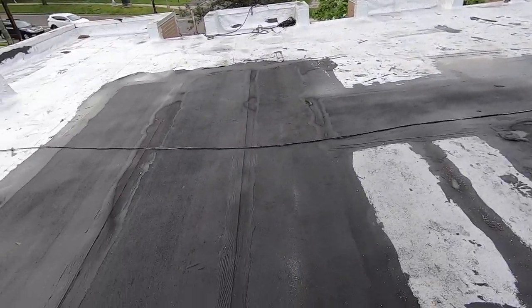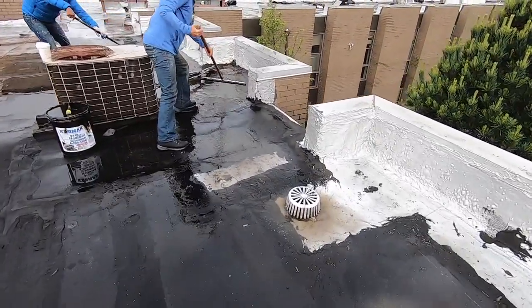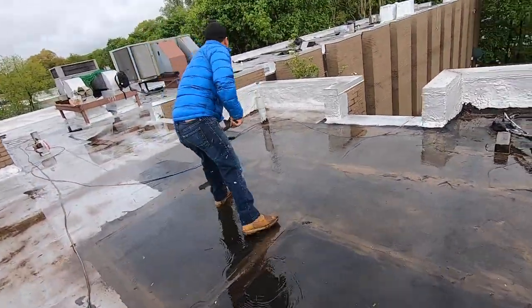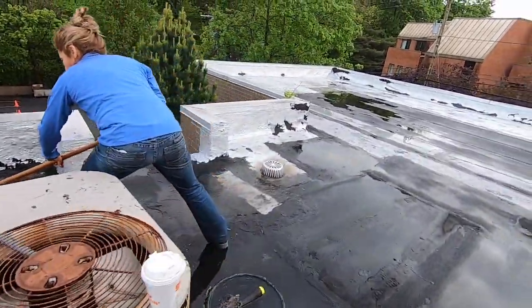They have so many leaks, but it's not that the torch down is leaking where they've torched before. They've been looking at the wrong places for the leaks, but I'm getting to do the roof again regardless. Now I'm going to show you how bad it is. They've patched this — you can see how many times they've patched and patched. I think they've patched maybe ten times and they've created a pond here. So we're removing all this ponding water because there's no way for the water to drain.